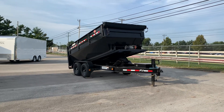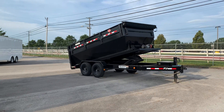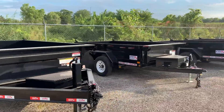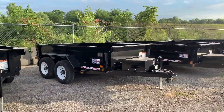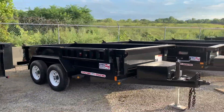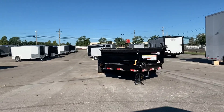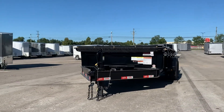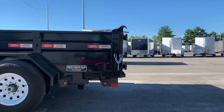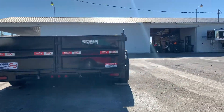Here are common dump trailer questions I hear often. One I hear every two weeks is someone asking why their hydraulic fluid cap popped off the reservoir and why it's overflowing. Typically that is due to a battery being drained — the valves inside the hydraulic system aren't fully opening, causing back pressure which makes the cap on the reservoir pop off. Make sure you charge your battery and that probably won't happen to you.